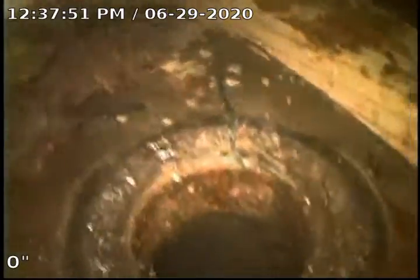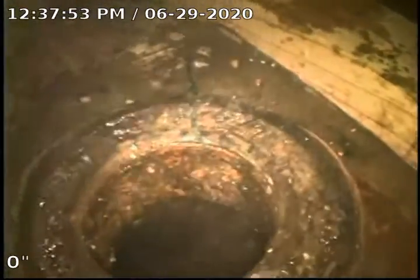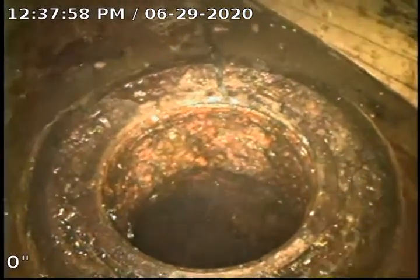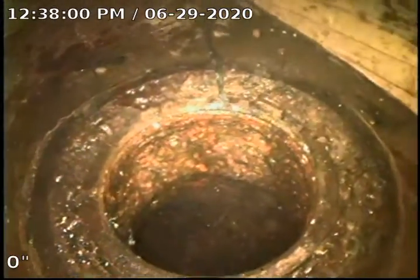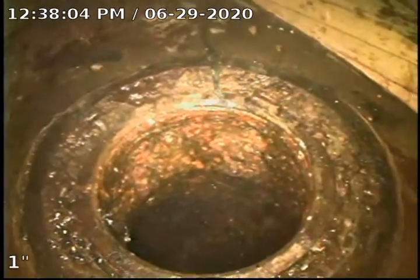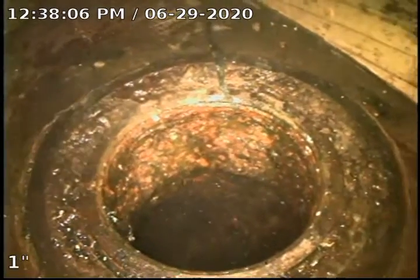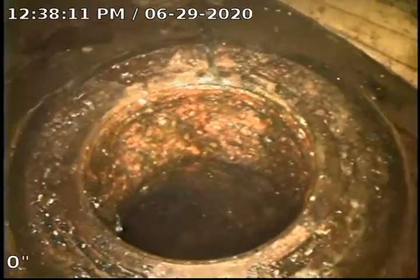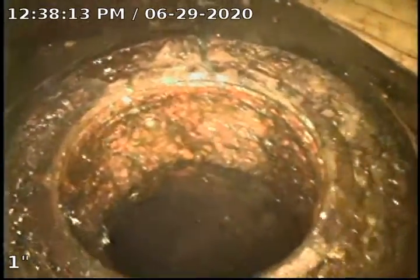Start emptying that tank. Okay, this is going to be our final video. We've done jetting with a root rat to clear roots. We've also tried to work on an area of calcite, and possibly we've located a resin slug. Also, we've used the forward spray head to clear through a belly and flush it out. So this will be our final video.